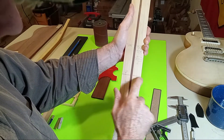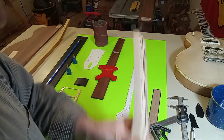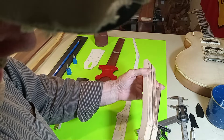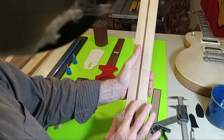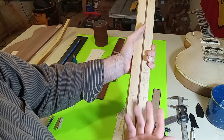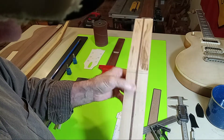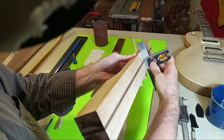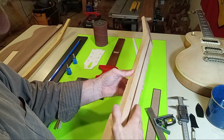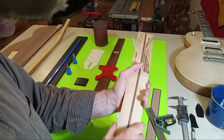I was watching that 16th fret location — that was the most important thing. If I was nice and true right there, I didn't have to worry about the ends. Once I began to see it was starting to tack, I started easing clamps in while holding it in my hand for about 10 minutes. Then I put a clamp on with no major pressure, verified nothing crazy was going on, and kept these surfaces beautiful and flat.